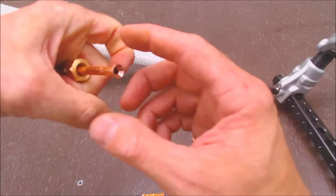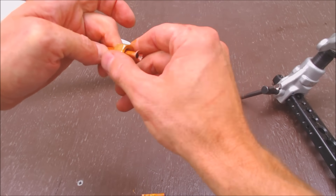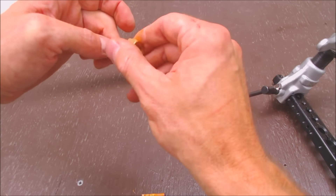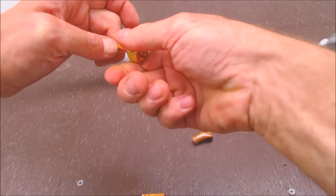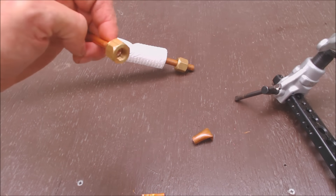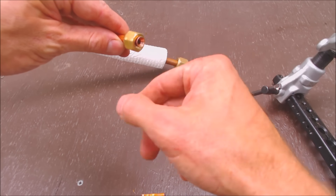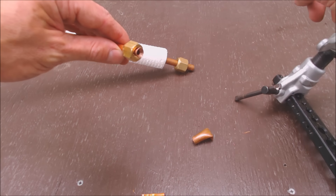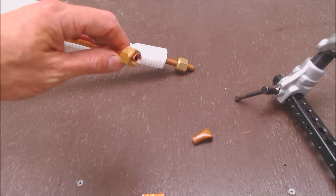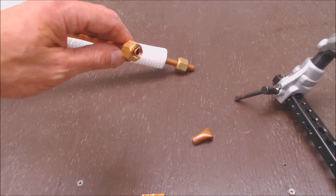So there's your flare — you see right there. We are taking up the full distance and I can just screw this in — there's room right there, so we're good. I'm going to go ahead and put a little bit of nylog right on here and also on the copper tubing next to the siding before we go ahead and tighten this in.